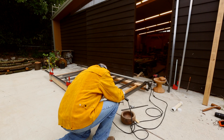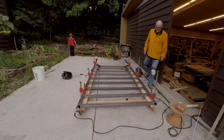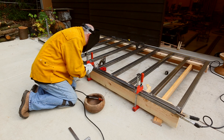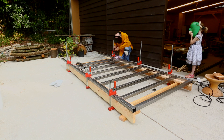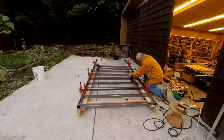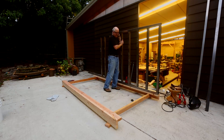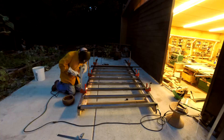I'm not a welder and this isn't really a welding video — I'm not very good at it. I started by tack welding the pieces together at points so I could still adjust things as needed, sort of creeping up on getting it welded together. The kids came out to watch. I'd weld a little bit, then grind it off, look, weld, and grind — it was a long slow process. When I got one side pretty much done I could flip the piece over, lay it back down on the same platform to confirm it was flat, then weld the other side — welding into the evening.